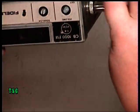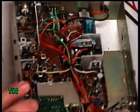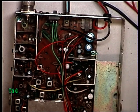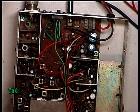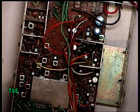So we'll now switch it on. It's on channel 20, which is handy. I've got a mic plugged into it and the external speaker plugged into the test equipment. There's no switch-on thump so there's no audio. Going to transmit and see what we've got — it's doing two watts straight away and it's near enough on frequency. I'm going to go through the synthesizer setup with you because it's quite a complicated one on these; there are quite a few adjustments under the screen plate. We've got transmit, but I can't see any audio and we've got no receive.